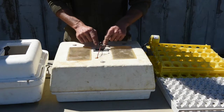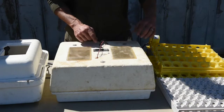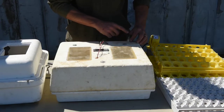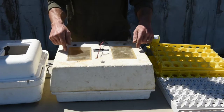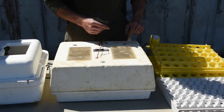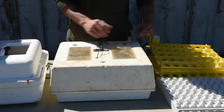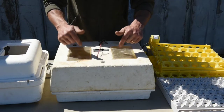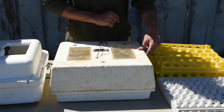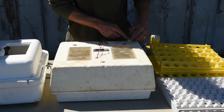What I wanted to show you is I put a digital thermostat in them — this is an Inkbird thermostat, a 120-volt thermostat. I drill a hole in the back and put a tube in with a little cork. This tube goes to the bottom of the incubator so I can pull the cork out and take a turkey baster with some distilled water and squirt water in there. We look at the humidistat inside, and if it needs more water we just add a little — we don't have to open the incubator up. That's one of the modifications we make.